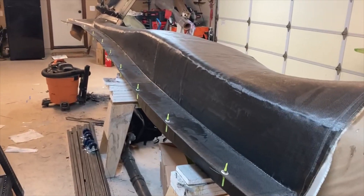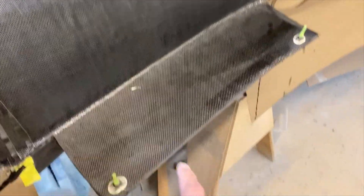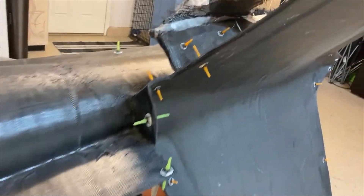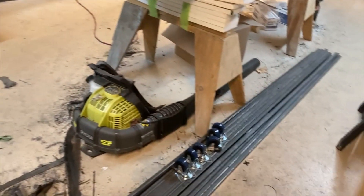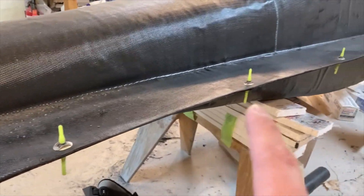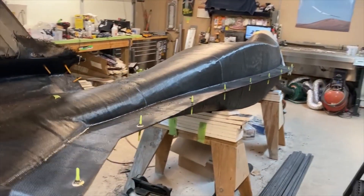The other half of the mold is done now. I've also drilled all the locating holes and bonded in the nuts, done some trimming and sanding, so it's just about ready to come apart. I still have a little bit of trimming to do in a couple of spots, and I still have stands to weld together but haven't been able to get that done yet. I'm going to trim those little spots up and I think I'm going to pop it loose today. I might be able to get the tail off but I'm not sure I can get the fuse half apart without some help.